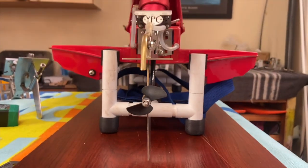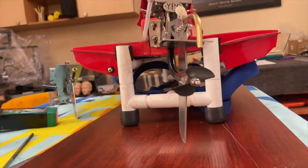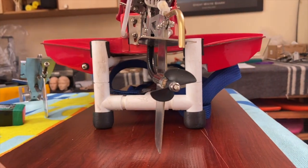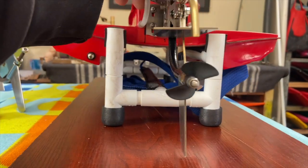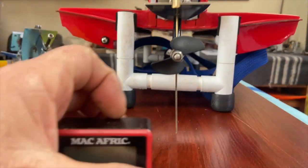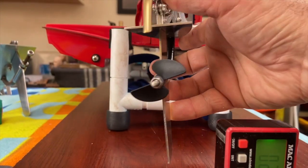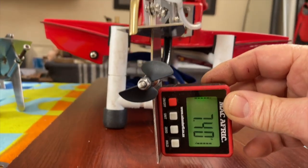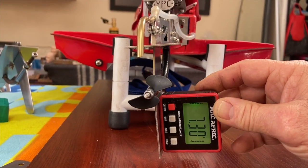You can see how the leg is basically perpendicular to the running surface of the sponsons. When I execute a turn — look at this angle — if you look at the angle of your skeg in relation to your sponsons, we have a 7-degree camber, both sides equally. Maybe I can set up the gauge here — it's around 0.1 there. If I trim the leg over and put the gauge on the skeg, you can see there's 7.5 degrees. It's about 7 degrees of camber. It'll obviously depend on the extension of your turn.